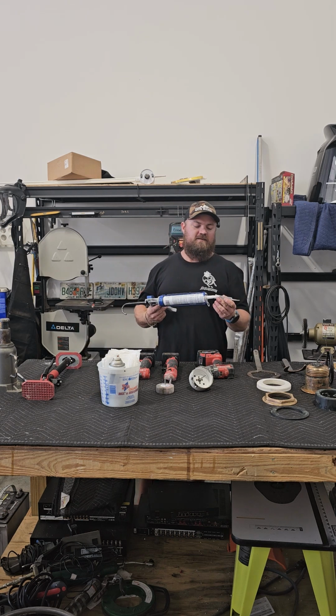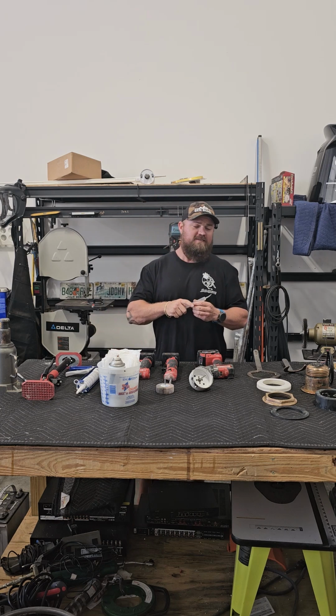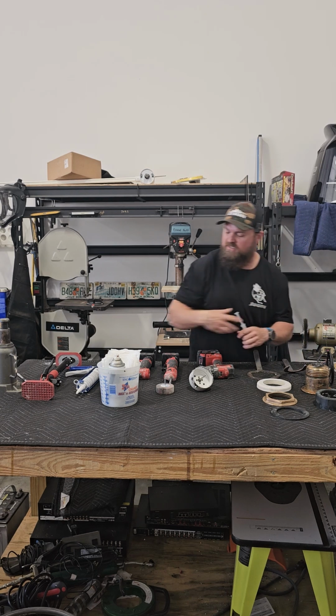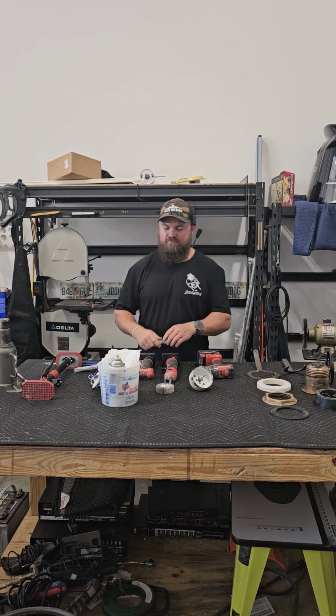I also get these little syringes off of Amazon. You take the caulking gun and you fill the syringe up. Much easier to bring inside the boat. Not necessary, but I've always found it to be a great option. When you're trying to get on the backside of a transducer in a tight bilge, this is much easier than this is. But do it how you want.